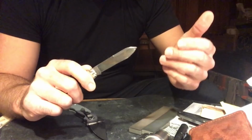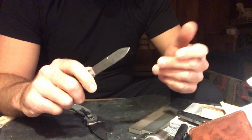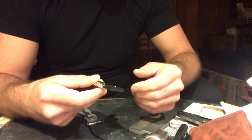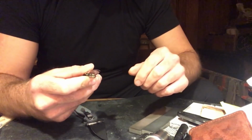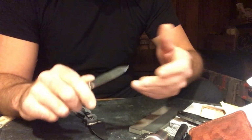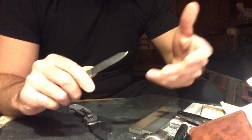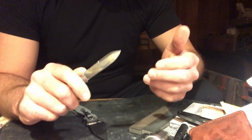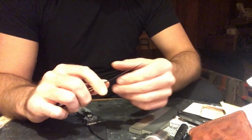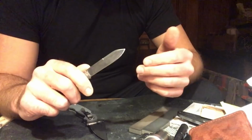It's something more to consider when I open one up and I go to sharpen it the first time, the idea that the steel may be overheated. I mean, the other thing to consider is with Great Eastern Cutlery, they're very thin. They're ground very, very thin. So overheating them is going to be easier because of that. There's simply less steel to distribute any heat that's there across. In some cases, I've gotten GECs brand new that were 1/3 of a millimeter behind the edge bevel. It's extremely thin.